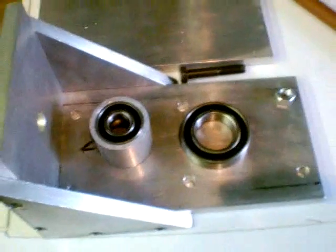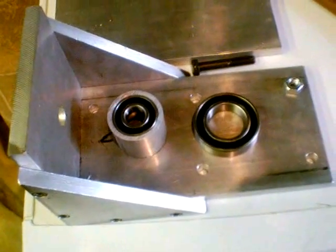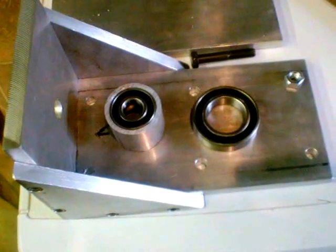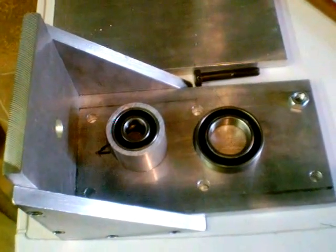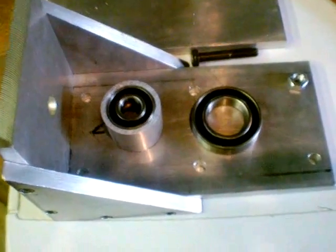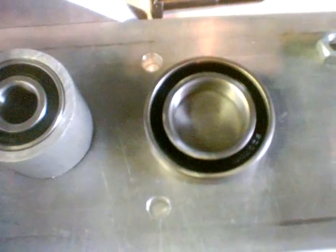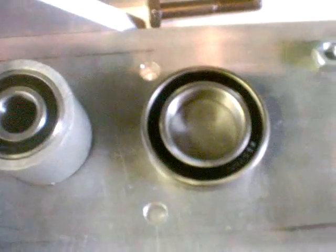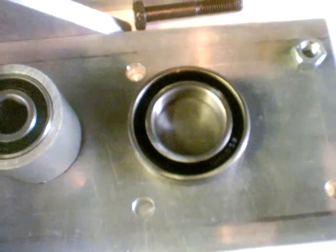All the bearings I'm using are metric bearings. Don't go to a shop to get them — go on the internet. The little bearing on the left was about £2.50 plus a pound postage — standard metric. The ones on the right cost me about £12–£13, and they are some humongous ones. I decided they fitted the aluminium I had machined down. Use bearings if possible because they last a long while, and make sure you get sealed ones to keep dirt out of the actual bearings.